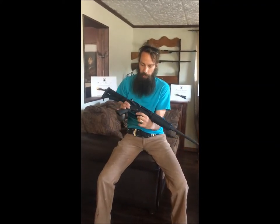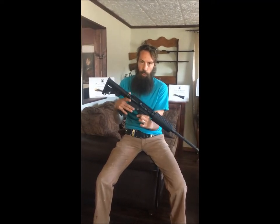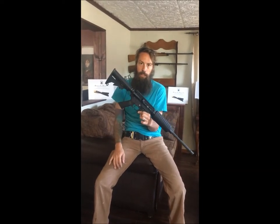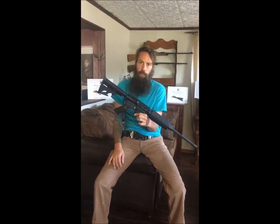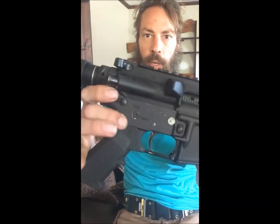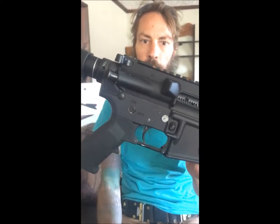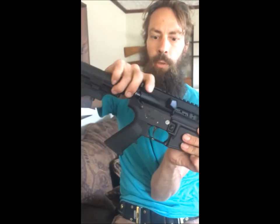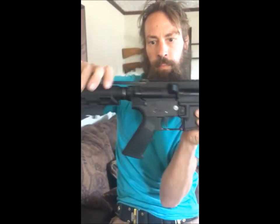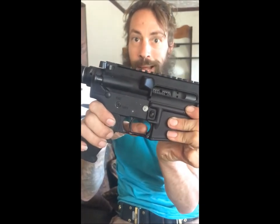If you are not careful with boring out your pinholes, they are going to be oversized and it will make the gun unsafe to shoot — it's not something that you can fix. You can see in the safety how much gap there is down here. It's pushing the safety up out of the way of the trigger mechanism, so we're on safe — and it's still firing. Not good.